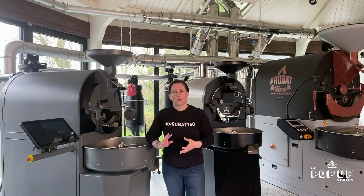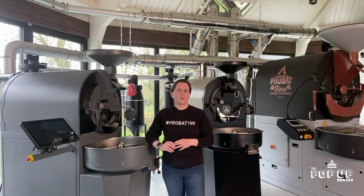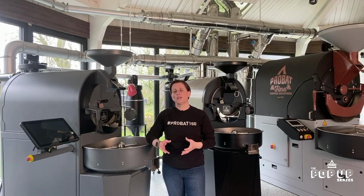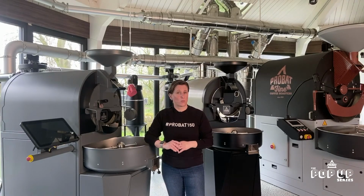because the first 2 batches you should use to clean off the machine. So of course, by the time the roasters are built in our factory, there is some oily stuff which is inside. There might be also other things that you firstly need to clean out, and for this reason you always take a batch or 2 and just take cheap coffee or maybe cherry stones to manually wipe off all the oily parts which are inside your drum probably.